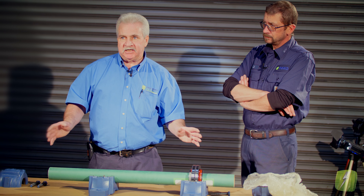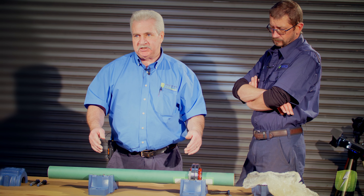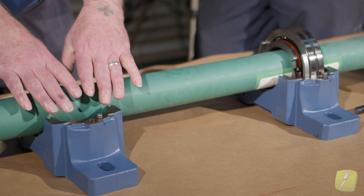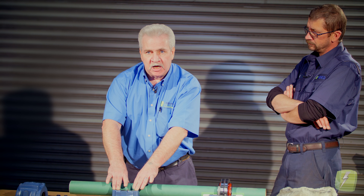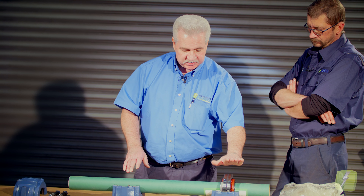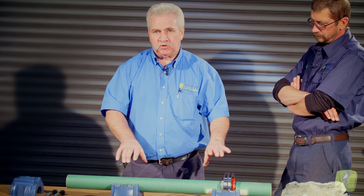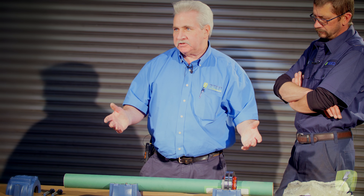I hope this is something you guys will pick up on. I think it's a little better to describe it this way so you get a better idea physically — seeing that you're moving your shaft, watching it grow, and having your bearing move with that shaft — giving it room in the housing at what we're calling the non-clamped end, non-expansion end, or expansion end. This is the non-expansion side. This right now would be the expansion side. There's nothing clamping the bearing other than the inner race; it will grow with the shaft and is allowed to move within the pillow block housing or the motor housing.